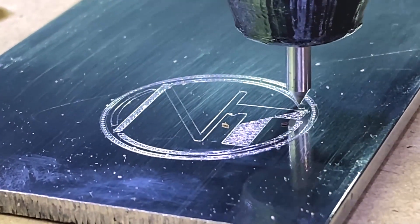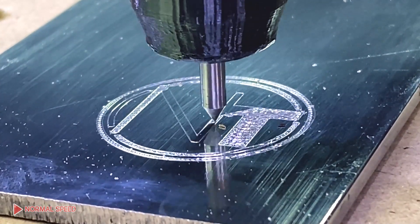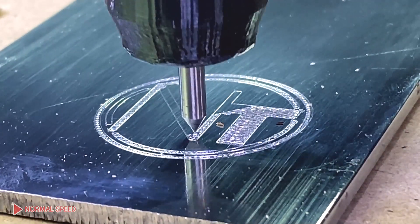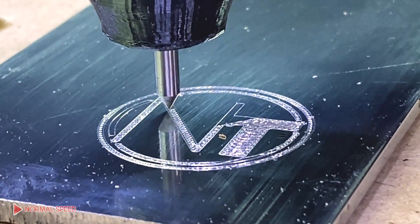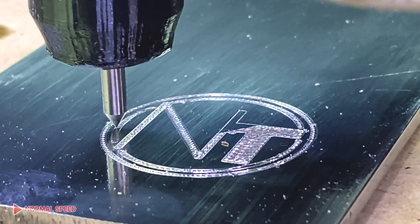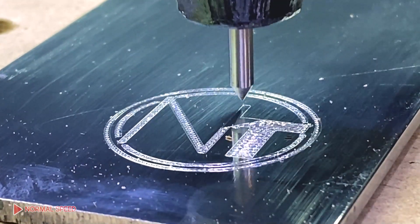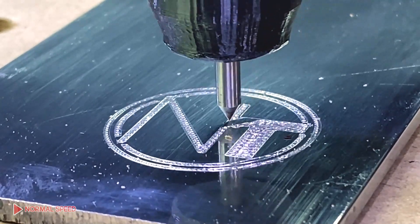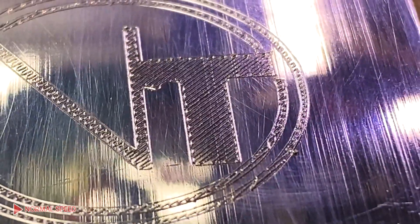I won't be showing you today how I created this toolpath in Fusion 360. However, there are some really fantastic YouTubers such as Winston Moy who did a great tutorial on how to set up diamond bit engraving in Fusion 360 — I suggest checking out his video, linked below. Essentially all I used in this toolpath was an outline trace and a parallel toolpath on a 45 degree angle to create the infill, to complete the logo of my channel. Diamond engraving does leave a slight burr on the surface, but I'll leave that topic for another time.